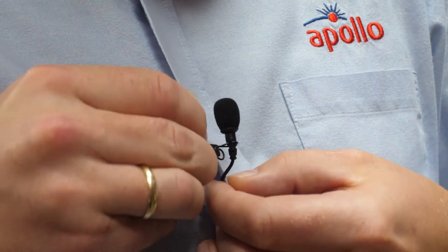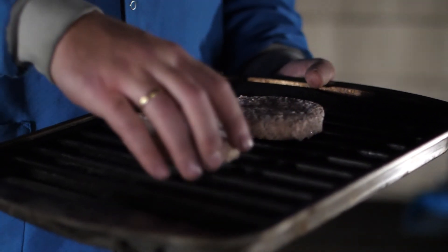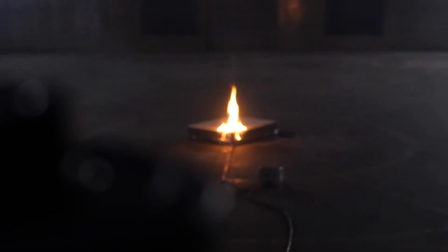Michał Ozon, Validation and Regulatory Compliance Lead. During the development and testing phase of our UL 268 edition 7 smoke detectors, our focus was on the two most challenging fire tests. The first one is the cooking nuisance fire — for this test we need two 4-inch hamburgers, placed on the broiler tray under the grill element, with the oven door open with a gap of 5 inches. The second test is the flaming polyurethane foam fire. Running these two tests back-to-back allows us to check that the algorithm correctly rejects the nuisance alarm but quickly detects the fire.